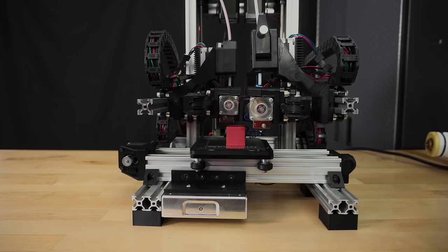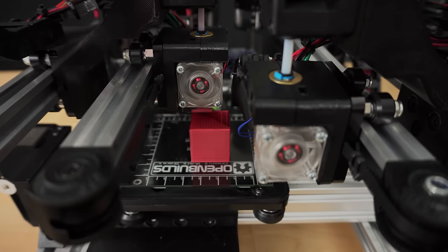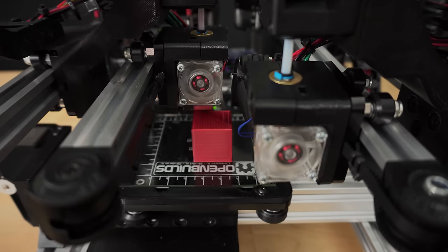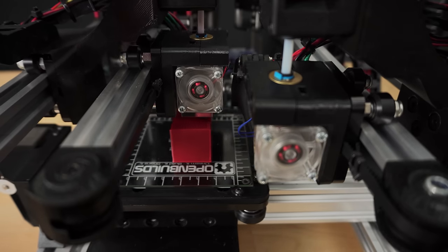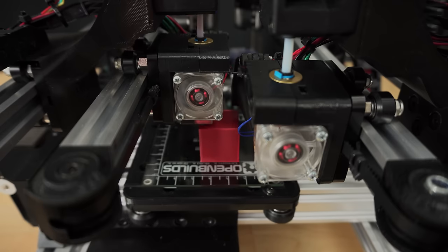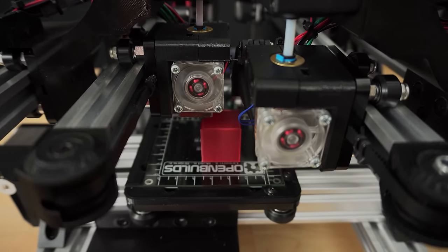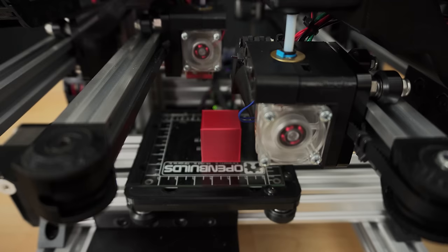It's kind of hard to see on the video, but as the filament is being laid down for the top layers of the cube, there's a small amount of space between strands. This suggests that the extruder is not depositing enough filament, and thus the flow rate, or extrusion multiplier, needs to be increased. The extrusion multiplier varies from filament type, so it's not uncommon to have to adjust this setting in the slicer software. I am guessing that this under extrusion will result in my cube being slightly undersized. Let's go ahead and measure it.